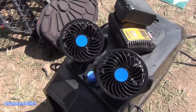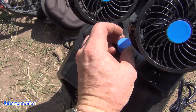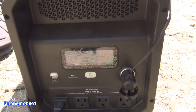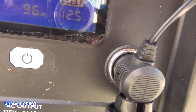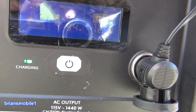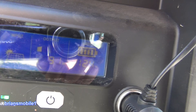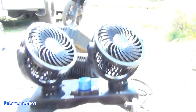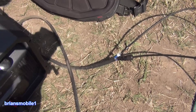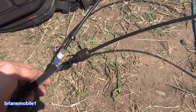My understanding is they say don't have it charging and running power at the same time — it's not made for that. You can see the solar panel is connected, the little light says charging, and I've also got it plugged in. I'm also charging a little chainsaw battery via 12 volts. I just took some solderless crimp connectors and adapted the connections to make it work — real ghetto, but just to get by.